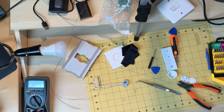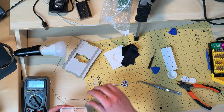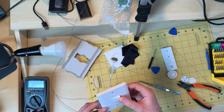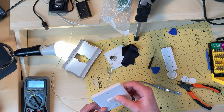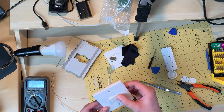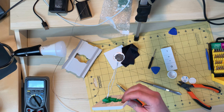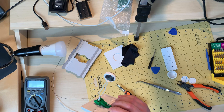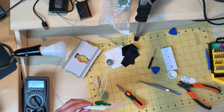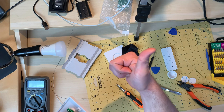I've had success, so let's get my switch. One goes in common, hopefully without breaking off. Hold down to dim. If we could make this robust, we'd be able to use any spring-loaded retractive switch you like with Philips Hue lamps, which in my humble opinion would be game-changing. Why do they not do it? I don't know. But proof of concept — it works.